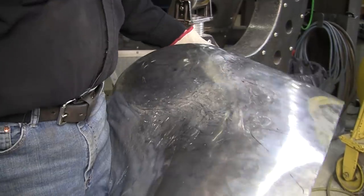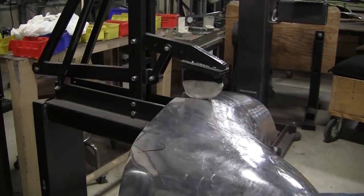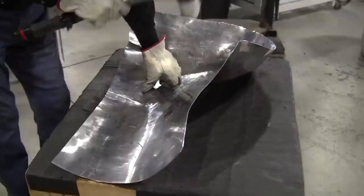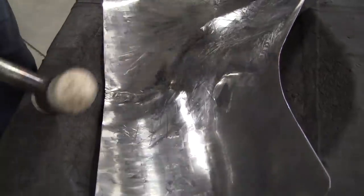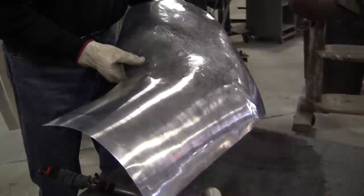Put the two shrinks in right here. Let me try to do that. All right, I'm going to use my gathering tool. Put a little shrink in here. I could do it with the thumbnail die, but we'll try this way. And I go over to my shrinking facilitator. My two shrinks, now let's planish them out.